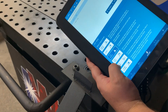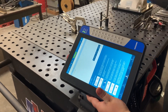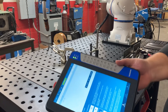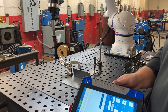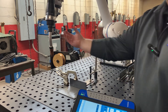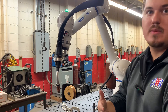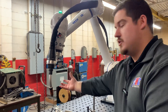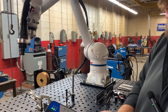Lastly for frame types, you have XYZ user. This is for setting up a special frame — for an external axis or similar setup. In this case we don't have one configured, but if you had another piece, like a gripper on the end of your part, and you wanted a reference point at the center of that, that's how you'd set it up. You'd control it the same way as tool, just on a different user-defined reference point.